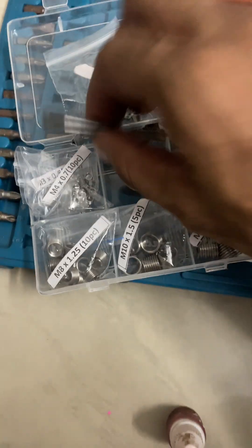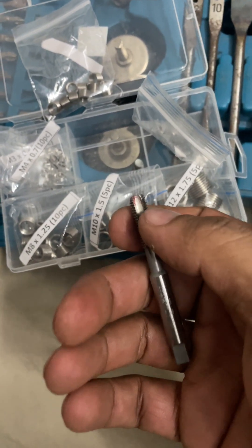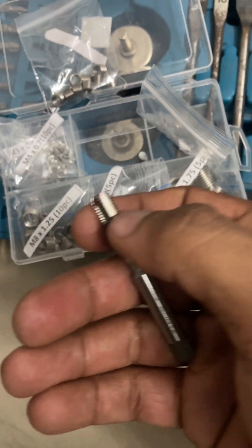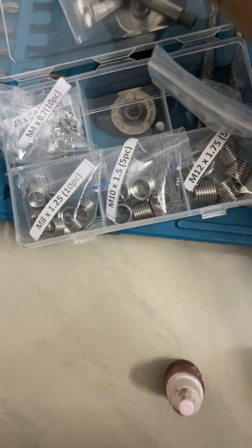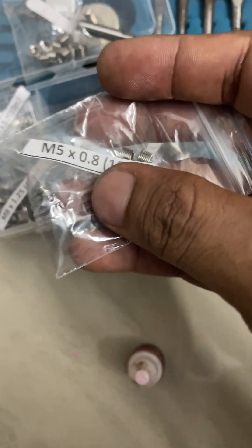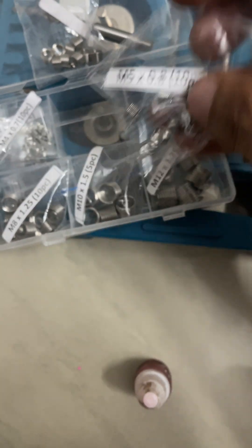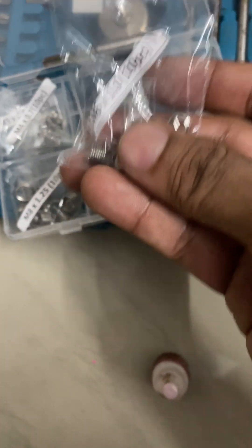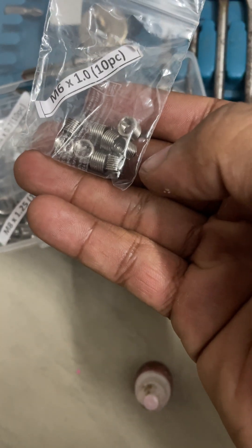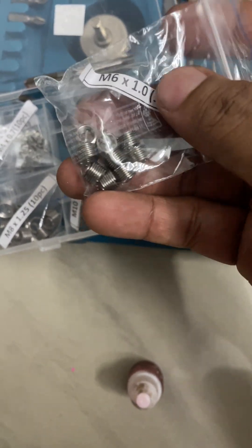So that was the tap — that did its job. I made about 8 threads; I went in 8 threads deep. And then this is the helicoil from Amazon. Not really good quality stuff, but for low torque applications it's totally fine. And this is the one I need — it's an M6 x1. I'm going to go in with this and fix this stripped hole.